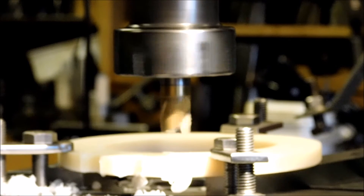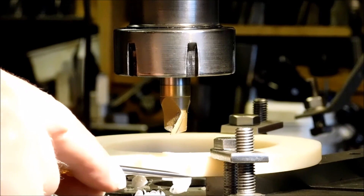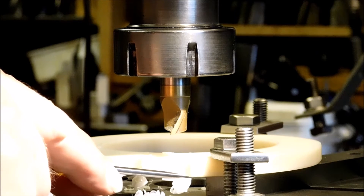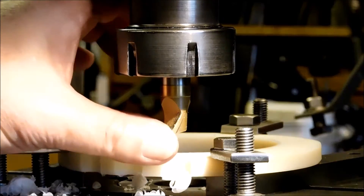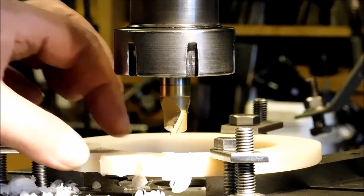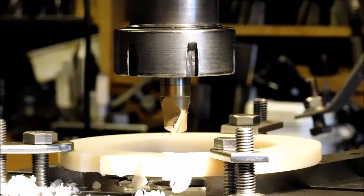Especially the last millimeter here — because of the gummy material, it's dragging the chips instead of cutting it. Maybe I have a weak corner — no, I don't think so. It's just not the right tool to cut this material here. But that's a finger ring done. Now I'll switch over and take the center ring where I only have one cut.